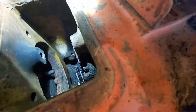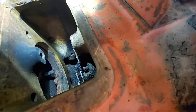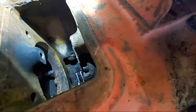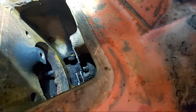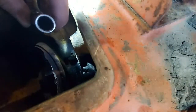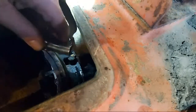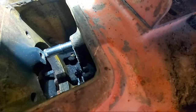Okay, so we're going back down into the hole. Gotta take that hub off. Those are 12-point bolts on it. And I have this specific socket that sits in a drawer and pretty much only gets taken out when I'm doing this. It's this socket right here. Reason being, it's a 12-point, and the other 12-points that I have are all impact, and the wall is too big to fit in there. So I had to buy that many years ago. As you can see how new it looks, it doesn't get used very often.